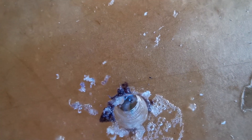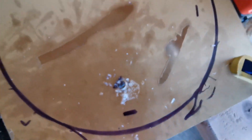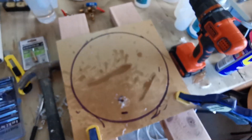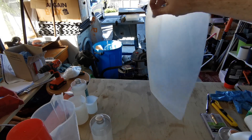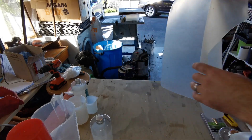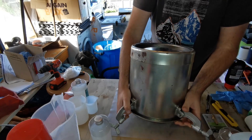Tapping the acrylic allows you to install the fittings directly, and that makes for a nice tight bond which helps create that vacuum. The next step is to create an air seal so that the lid can tightly seal to the pot. I used a sheet of silicone for this purpose. Now mark out the edge of the pot onto the silicone.